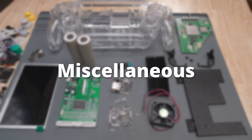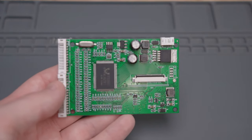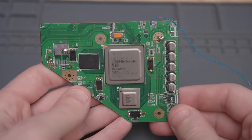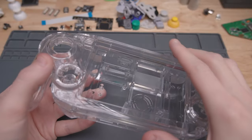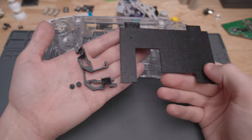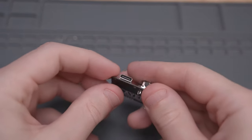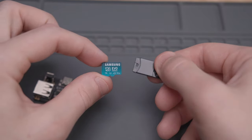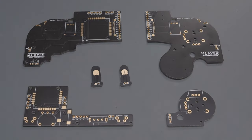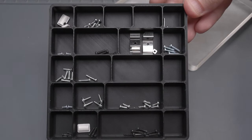The last section of the BOM contains all the other parts we'll need: a 5-inch 16x9 IPS screen and associated driver board, two 21700 lithium-ion batteries and battery clips, our trimmed Wii from the previous video, a cooling fan and two heat sinks, the 3D printed shell, the PMS2, a PMS PD from 4LayerTech for USB power delivery charging, the low-profile SD card adapter included with the PMS PD, the custom Ashida PCB set from 4LayerTech, and the screws from the Wii case we disassembled.